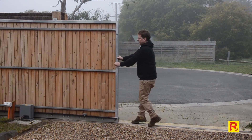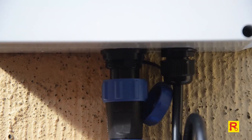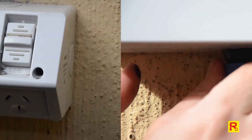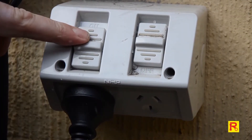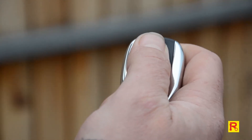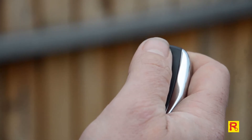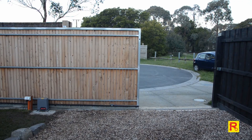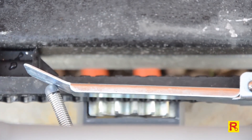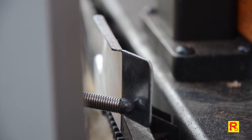Now, position the gate in the middle. Close the manual release bar and use the key to lock. On your mounted low voltage power supply, push in the plug and tighten the blue collar to secure firmly. Plug it in and switch it on. Use the factory-supplied remote to test that the gate moves backwards and forwards. Now that the motor is powered, it's time to fine-tune the closing and opening position of the gate. Use the remote again to open the gate — the limit travel stop will hit the spring limit switch and the gate will stop. Adjust the limit travel stop's position if required and repeat this to set the final close position of the gate.